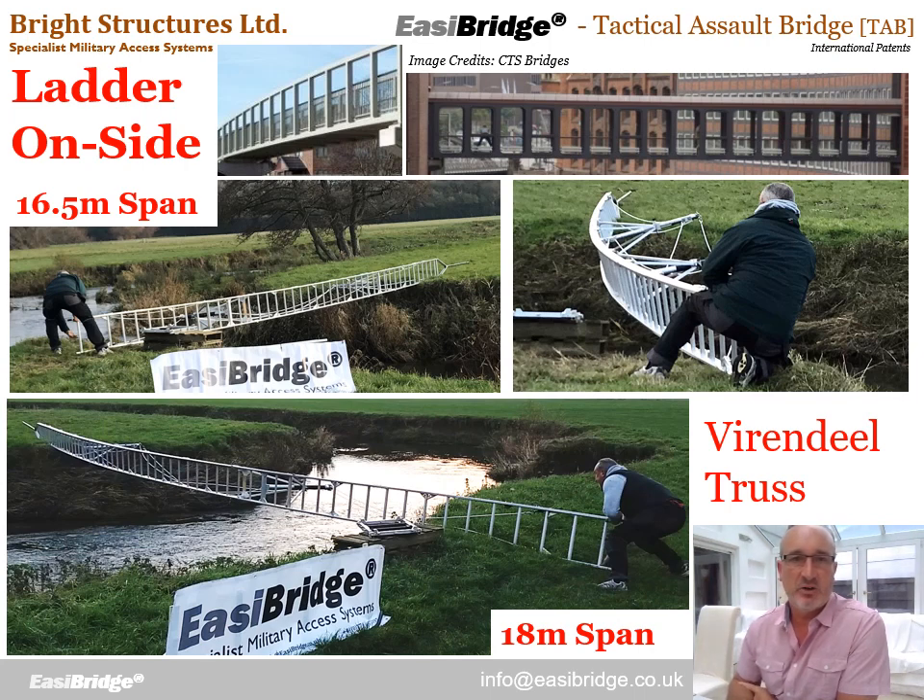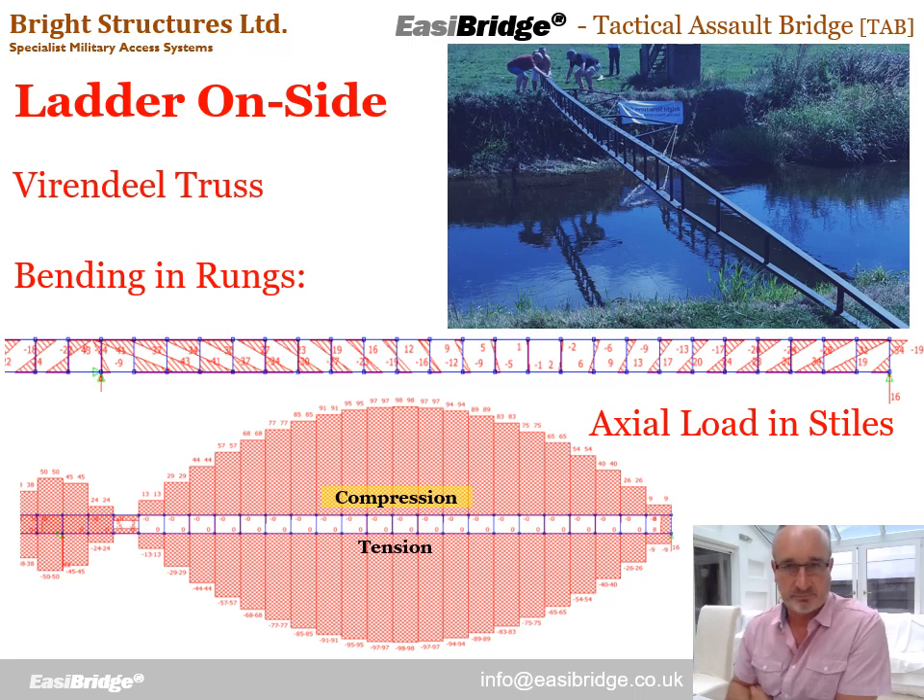The next stage of building EasyBridge is turning it on its side. We can see pictures there of up to 18 metre bridges. The obvious analogy here is Vierendeel truss footbridges, which are quite common — bridges that have no X-bracing or diagonal members, just a framework of perpendicular elements. That's exactly what's happening with our ladders at that stage. This sets up bending moments that can be quite onerous in the ladder rungs. Vierendeel moments are derived from shear, so they actually increase towards the supports, while the axial loads in the stiles — setting up compression and tension — peak at mid-span, just like a beam. Quite complicated bending behaviour occurs while the bridge is on its side.